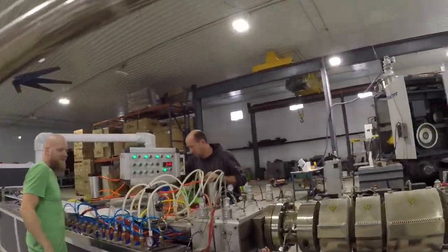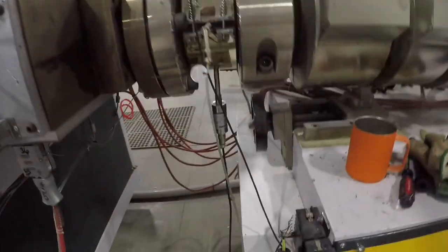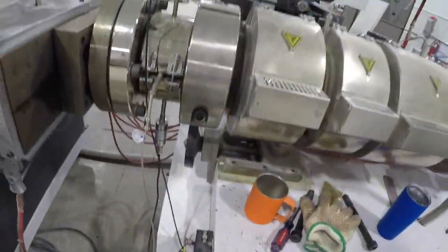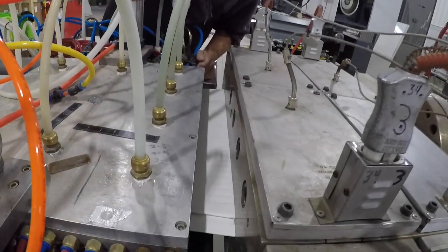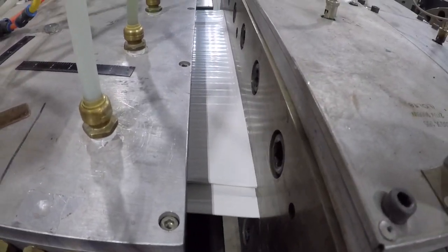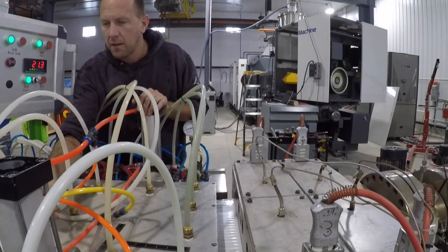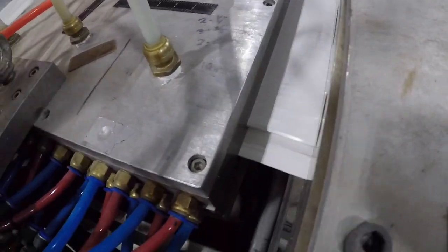When it comes out of the die, when it comes past this part to the mold, the material's leaving at 200 degrees centigrade. So I think we've got a lot of that figured out. When it leaves the mold, she's full and she's good. It's the top sheet or the top layer which kind of pulls together, and it forces us to lose our angles on the product. You can kind of see it there.